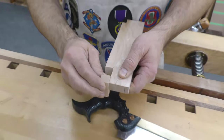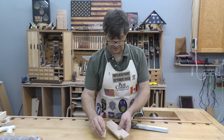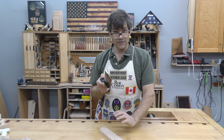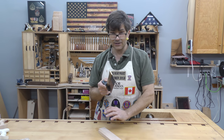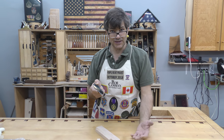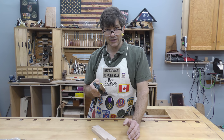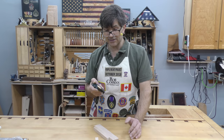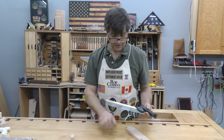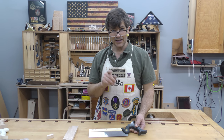That's what it's all about — and that's why the saw accounts for 70% of your ability to cut the joint. If you've got to come in and take a chisel and try to create that flat surface, your chance of success will really start to nose dive. This is the saw that will allow you in the first week to get to a point where you can do a dovetail joint you never would have thought possible. I've tried many saws and been doing this for a long time. I finally got frustrated not being able to find a saw with the proper set and actual rip teeth, so I ended up making my own — designed around my ability to cut the joint and, more importantly, my ability to teach others. We manufacture them right here and have been making them for 10 years. If you're looking to do dovetails and get it done right, get the saw, get started, and you won't look back.